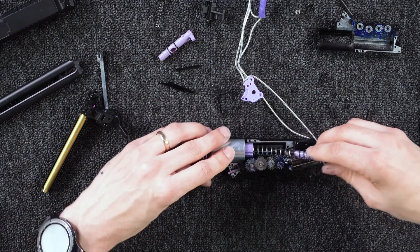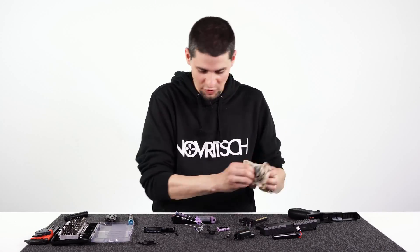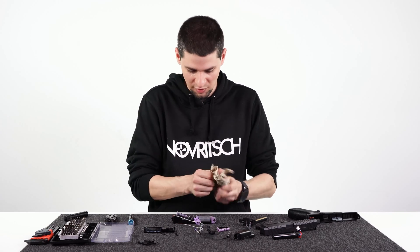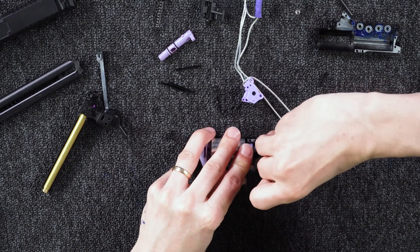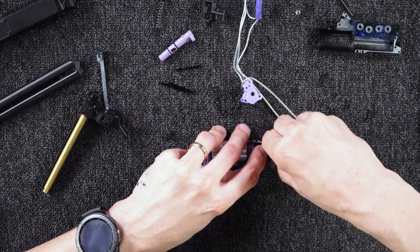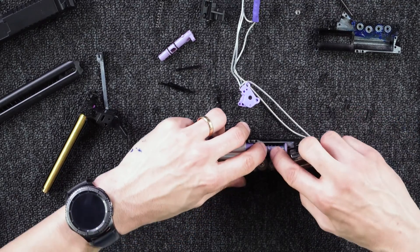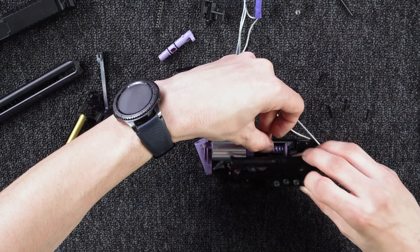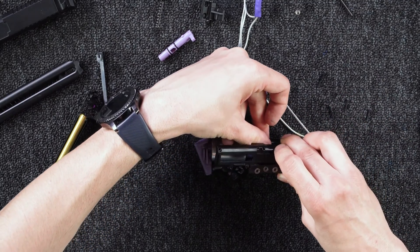Then we can take the spring and spring guide — we can actually tension it. I would actually recommend cleaning your hands, because if you're greasy you could slip the spring and it could fly off. Just clean your hands a little bit and try to push it in. Secure one of the legs of the spring guide inside its little hole — as you heard, it clicked in. This part fell off, but you can actually put it back in pretty easily. By keeping pressure on it, I can then align, first with the back end, the second part of the gearbox, so that they can catch the spring guide so it doesn't fly off.